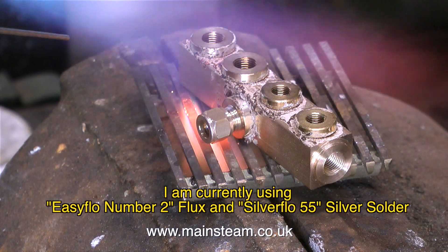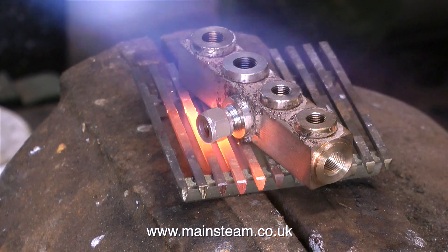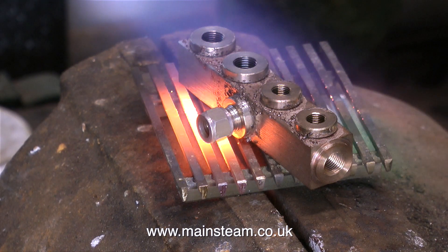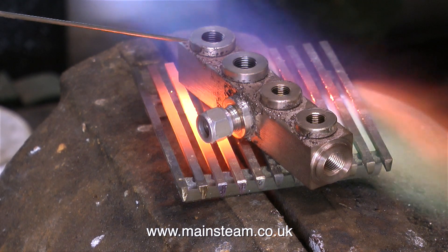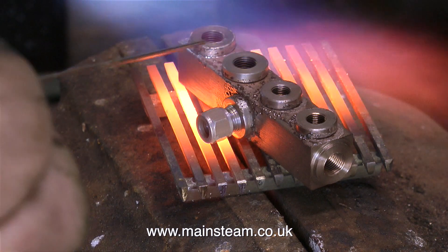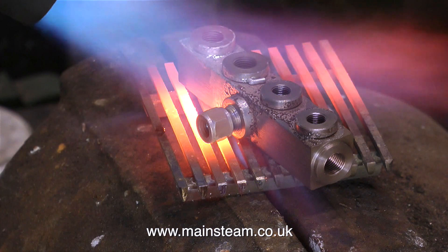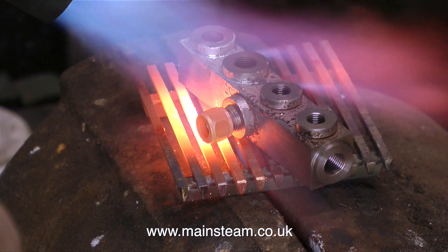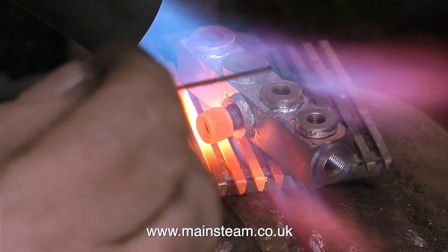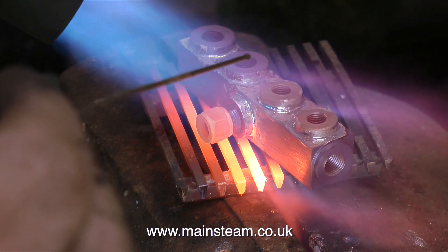I've fitted a nut to the threads underneath the turret in an attempt to prevent the threads from being overheated by the blowtorch. It would be much better if I had a brazing hearth, because firebrick reflects the heat back at the work, allowing it to be brought up to temperature more quickly. Here's the technique — plenty of heat, and as soon as the silver solder flux gets to be transparent, apply the silver solder. I applied this early, but as soon as the heat gets right it flashes around the joint. The silver solder is neatly flashing around the joint.